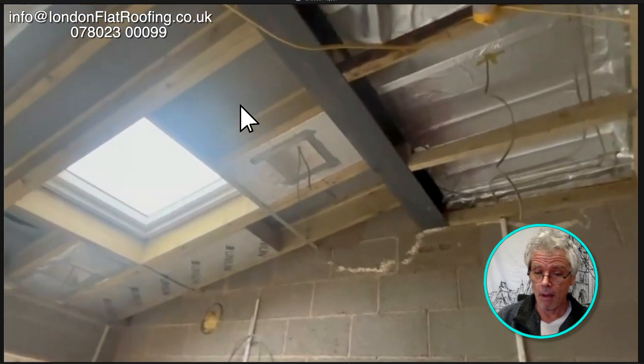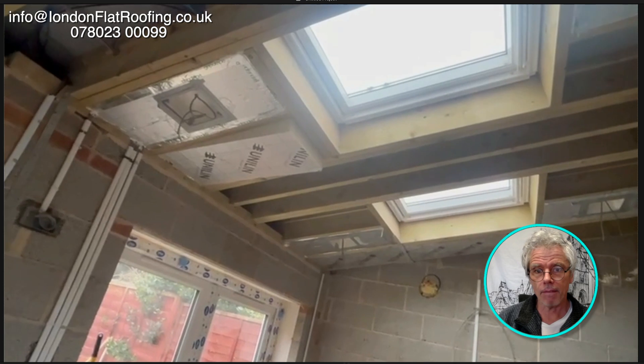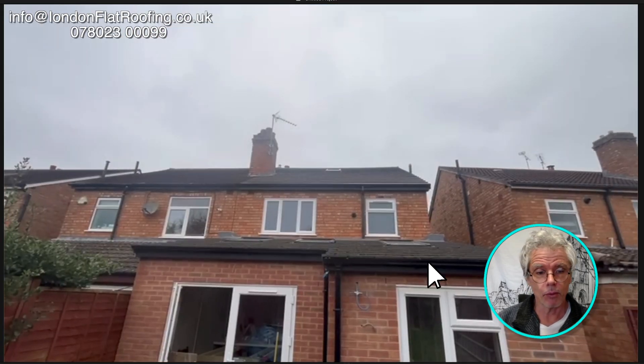Ultimately what he's going to have to do is strip the roof and do something about these low-pitched tiles. Realistically he can cross-batten and use one of the systems now on the market that puts a waterproof membrane underneath the tiles, so you're not relying on the tiles for waterproofing but on the membrane system underneath. At the same time he can add more ventilation from the outside. Yes, it will raise the roof height and there will be a problem where it meets the flat roof - but it's something he's going to have to do if this fails as it stands.